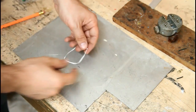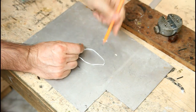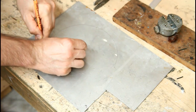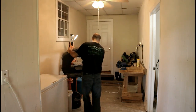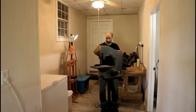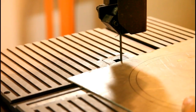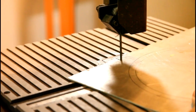After I got my piece of sheet metal, I measured the bucket and cut a piece of string to use as a circle maker to get a perfect pattern. This sheet metal is a little too thick for tin snips, so I'm going to drag out my old band saw. Unfortunately I don't have the right blade for this saw, so we're just going to have a go and see what happens.